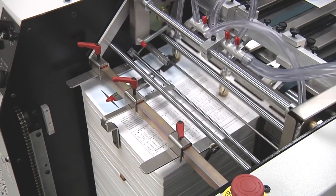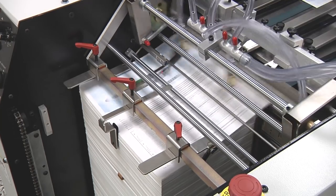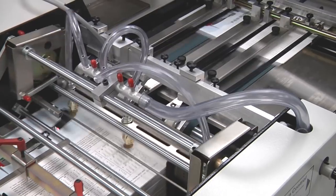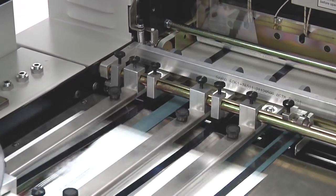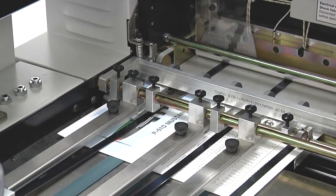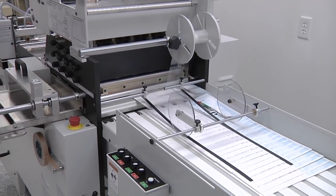The Excel feeder can hold up to 32 inches of stock and can be preloaded while the press is running to maximize productivity while reducing operator workload. Bigfoot suckers feed paper through a double sheet detector onto a registration table. Each sheet is then aligned to an adjustable headstop and side jogged. A sensor confirms the sheet position before a pinch roller grips and advances the sheet into the gripper belts. Precision gripper belts move the paper into the impression mechanism and then eject the sheet onto the delivery conveyor.